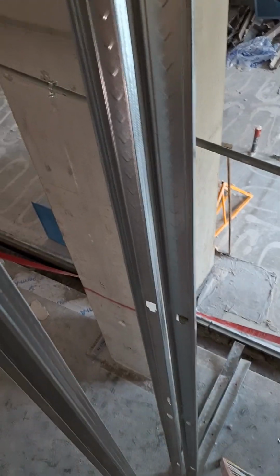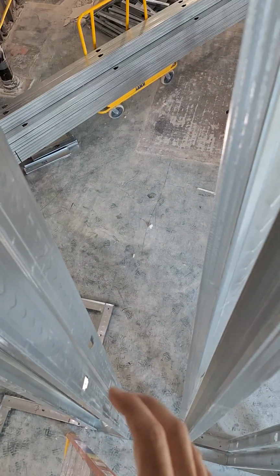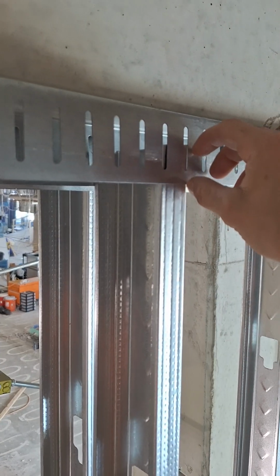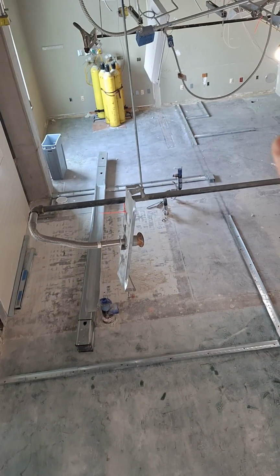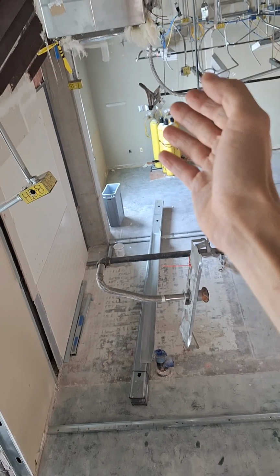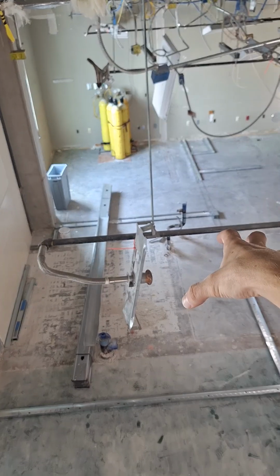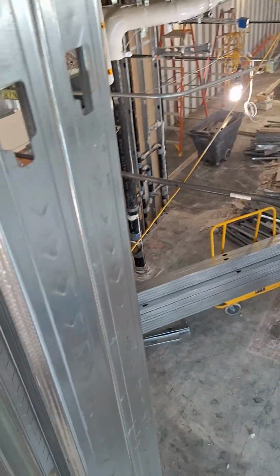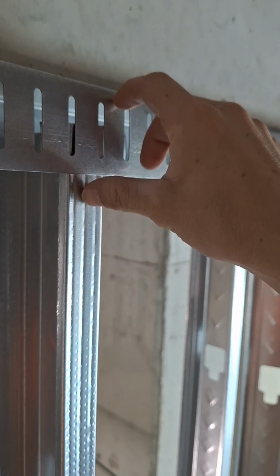However, if the floor settles, or as you put drywall on the walls, it adds weight to the floor, it will flex down. So these need to be able to deflect downward as well. And not just the sheetrock, but all your plumbing, your cabinetry, your flooring, your fixtures. In this case, the hospital beds, that's a more dynamic load. But all the things in there are gonna add weight to that floor. So it's gonna wanna start to sag just ever so slightly or deflect in the middle. And then also building settling again, which means it needs to be able to deflect down.